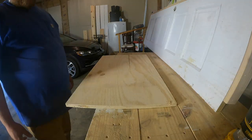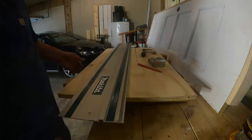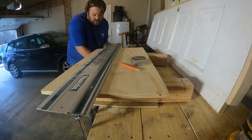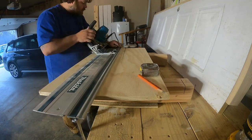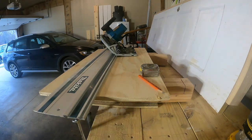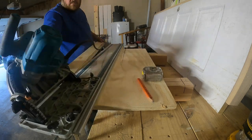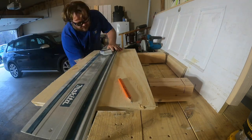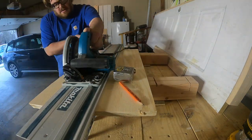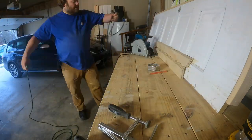You see me here cutting that French cleat. I just take a scrap piece of plywood, set it up on my sacrificial blocks, clamp on the track saw, throw the track saw over an angle, and just cut a line. You just want to make sure you leave yourself enough to put some screws in — I left myself about a two-inch piece with the angle cut, then a two-inch piece for the bottom, and this one you just cut straight. Those two pieces will fit together because they were cut at the same angle, which is why the angle you cut doesn't really matter.